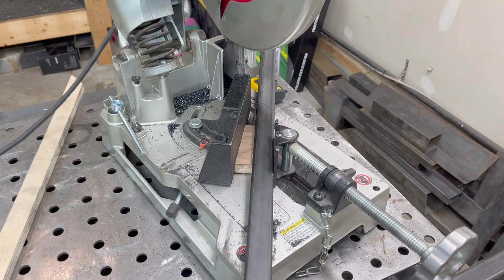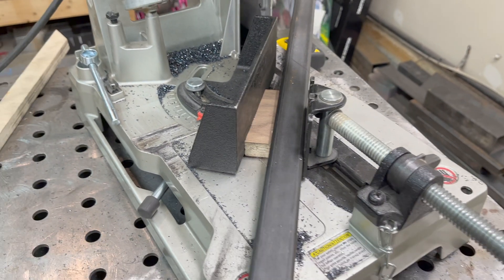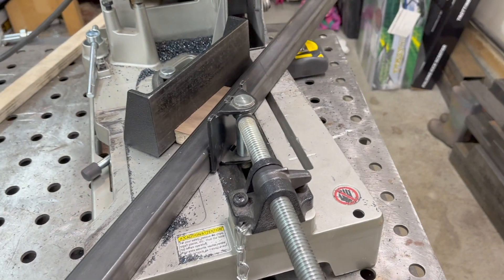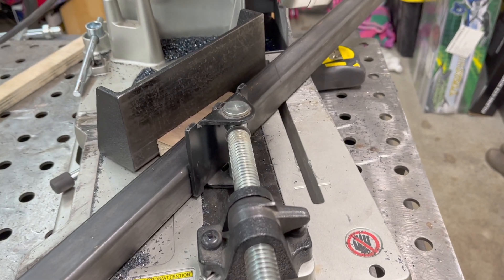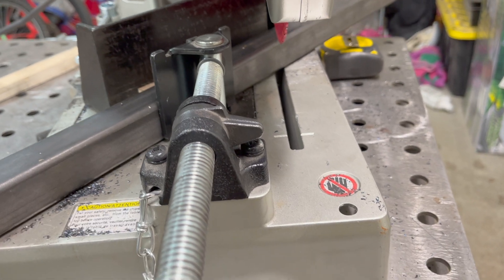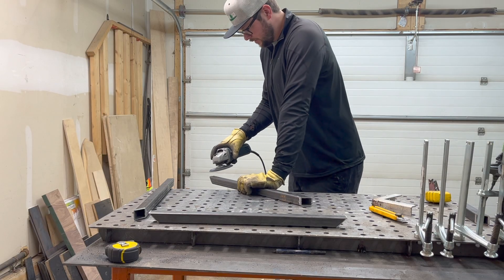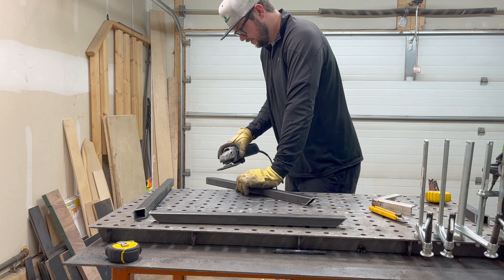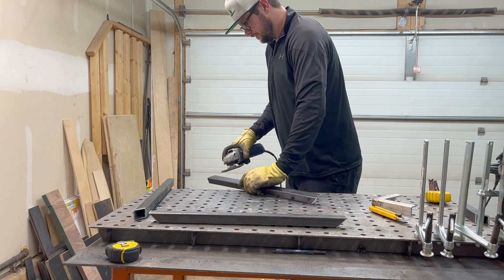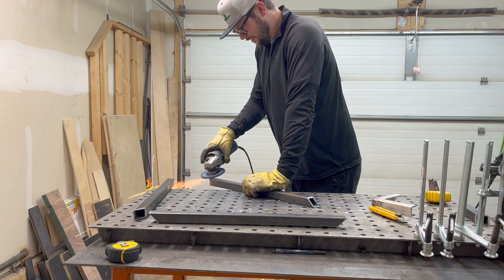One of the angles — the one in the bottom front of the chair — is too large for me to cut on my saw. So I use a trick that I've seen a couple other makers use, and that is to cut a wedge to basically make up for that amount. For example, if you need to cut a 60-degree miter and your saw only goes to 45 degrees, well then you'd cut a 15-degree wedge and place that against the fence. Then your workpiece is against that wedge, mimicking the 60 degrees that you need.